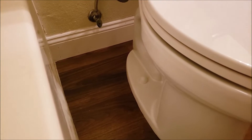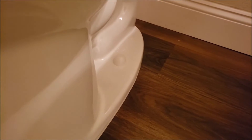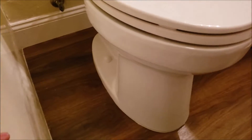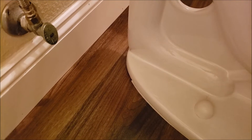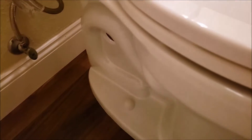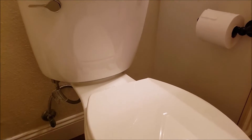So what we had to do was go around the perimeter using hard plastic toilet shims to prop it up, and we shimmed it nicely next to the bolts on each side where a lot of the pressure is. We flushed it many times — there's no leaking. Around the perimeter we caulked it almost to the back, but we like to leave the back open so that if there's any leakage you'll see it right away rather than having it cause damage under the floor. The toilet is filling, shutting off, and flushing correctly.